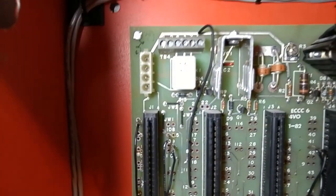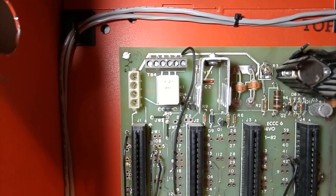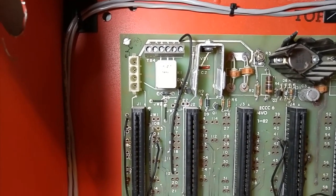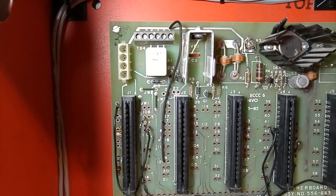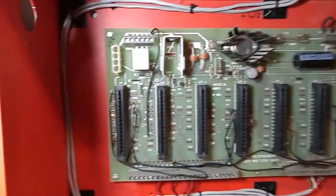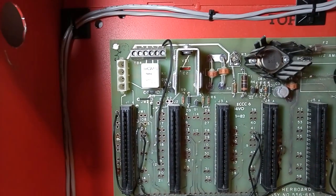Normally, this panel does not support four-wire smoke detectors. You would actually have to add a special card to be able to do it. And basically one way you could do that is you wire a relay through the constant power, and the relay drops out when you reset the panel. But that's because the output up here is constant 24-volt power output.